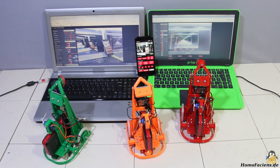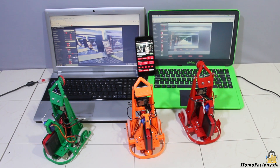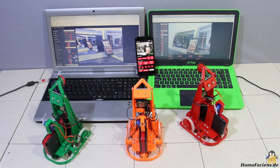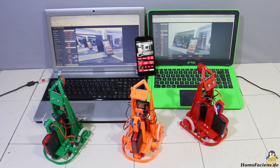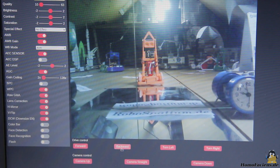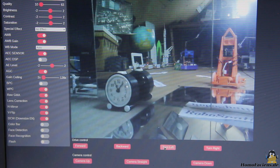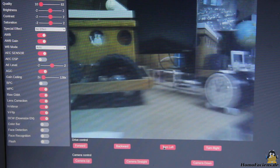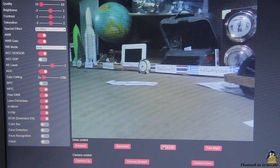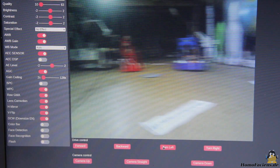No app is required for control, free from the constraints of vendor login systems from Cupertino, Redmond, or Mountain View. The purpose of my robots is to teach coding from scratch using free open source software, not to follow any trends of software dictators. Either single images or, as shown here, a video stream can be transmitted to the browser interface. The resolution can be selected via a drop-down menu — with a good WiFi connection a stream with 1024x768 pixels is possible.